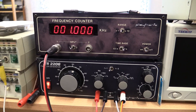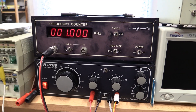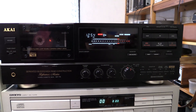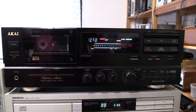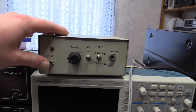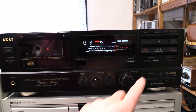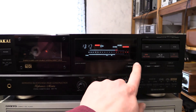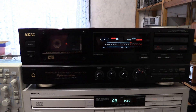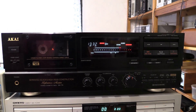That was actually quite a bit of a drama. I had to wait until this thing had warmed up a little bit because the frequency at first just kept changing. So we got one kilohertz coming out of there, going into the Akai GX75, and I'm just going to record the whole entire side of this tape with that one kilohertz tone at a level of zero decibels. It sounds pretty terrible. The tape actually does add a bit of hiss, but it should still be perfectly measurable.